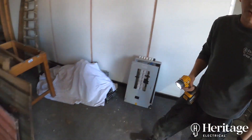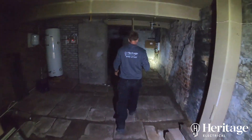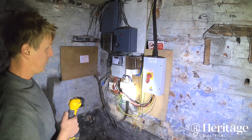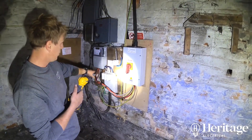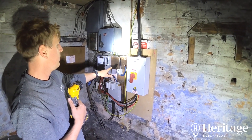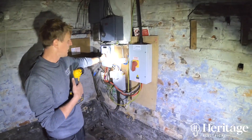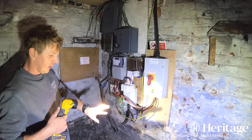And then there was another electrical fire. This is the main incoming supply for the entire building. This three-phase supply is split between three floors. When I originally quoted, I was going to split this up down here properly rather than just putting it into Henley blocks or tail blocks. So that when they open this floor or the next floor above, there's an actual supply for them to go into. But in this case, they just put the supply straight in. If anyone wants to rent this mid floor out to somebody else, he's going to have to sort this out and split the supply up. So there was another electrical fire down here.